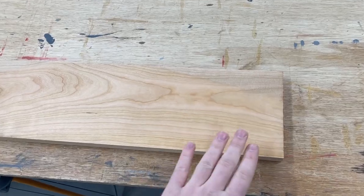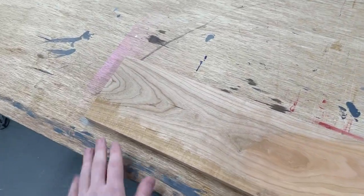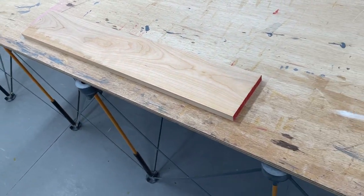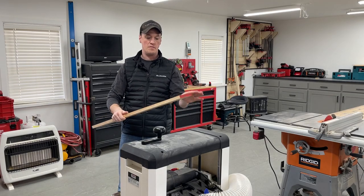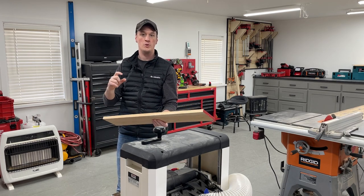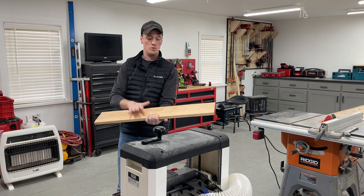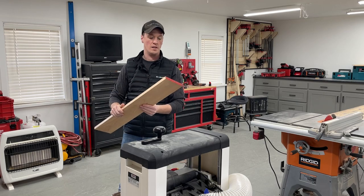After a couple passes you can see where I'm still cutting here and here - I still need to go lower to be completely flat, then I'll take it to my final thickness of three-quarters of an inch. Once I get this second face co-planar with the first one, I'm going to begin alternating it as I run it through down to my three-quarter inch thickness. That way I'm exposing new grain evenly on both sides of the board, which helps keep it more stable so it doesn't move again.